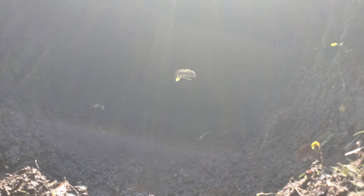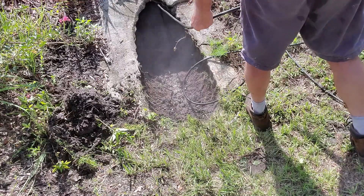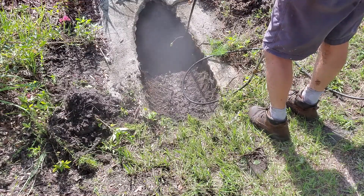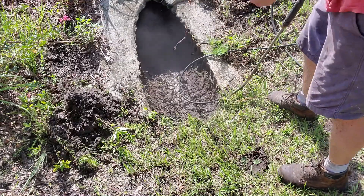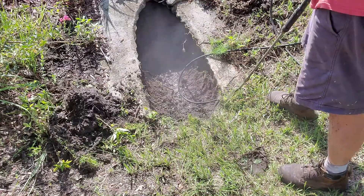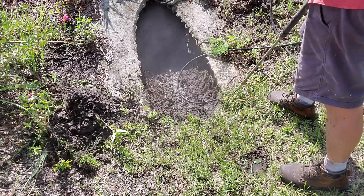You can see it's pretty open — I see just one spot right there in the center. If I can get that jetter down there this will be wide open. In the middle of the culvert there was a small mound of soil, and there's probably something going on there. I'll bet this galvanized pipe has rusted and heaved up right there. What you have to do is repeatedly pull that mini jet back and forth through that area to knock down that pile. The jets will pull out the debris, but because it's such a large pipe it takes several passes to break down that pile.